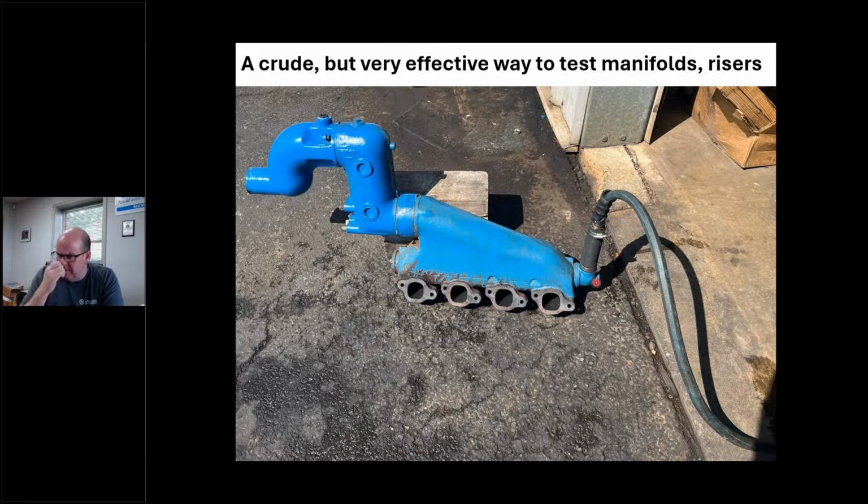Oh, Chris, got water in number 7 cylinder, right? What does everybody do? They rip the heads off. That's the worst thing you can do, right? Destructive diagnostics. I hate that. They think the head gasket's bad, block's cracked, or whatever. Okay, so he rips the heads off. I check the heads. There's nothing wrong with the heads, right?